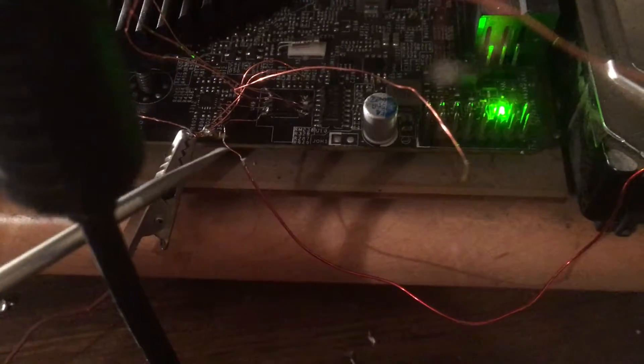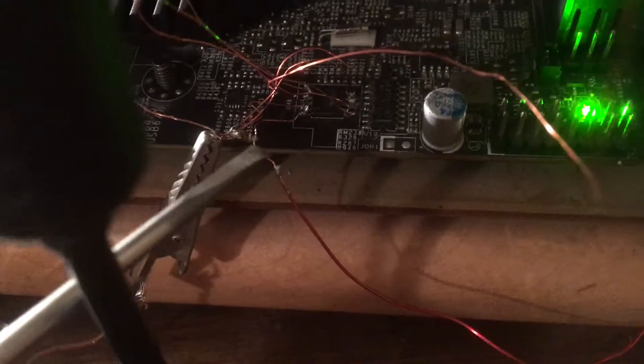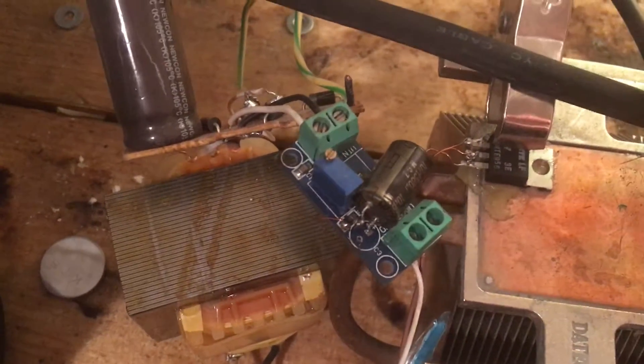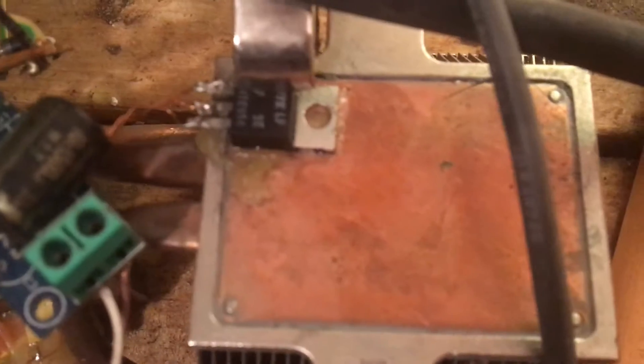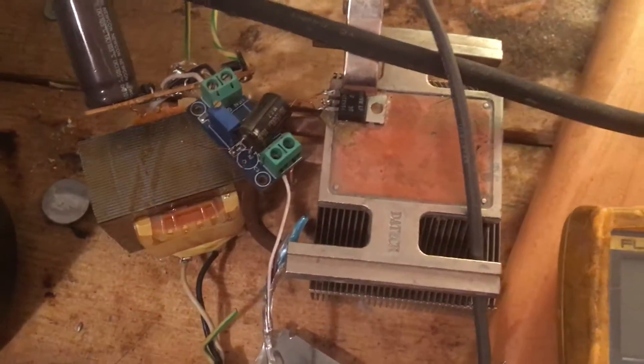If you're using plastic wire it's going to be hell on earth, so just use the thinnest magnet wire you can find. I smashed a wall wart on the concrete to get it out. This is the bypass capacitor — surface mount capacitor. Got this powered into a regulator. This is the regulator here — cheap, just something I rigged up. Adjustable regulator, NTE 956. You can dial it up or down. Bought that off eBay.